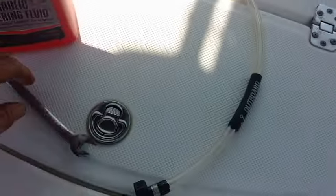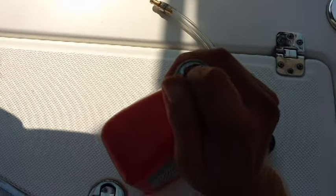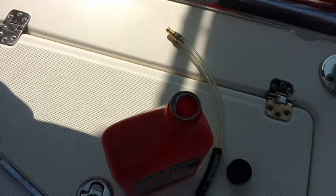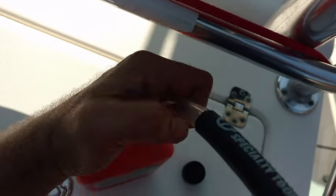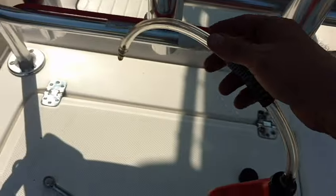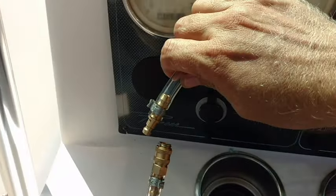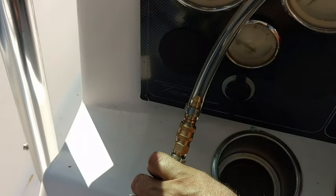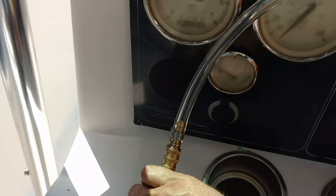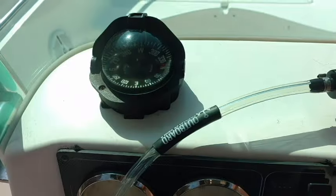Now up to the helm. Here we have our shiny fresh new bottle of incredibly pricey Sea Star fluid, which nobody wants to spill a lot of. It's probably a good demonstration of exactly how easy it is to use our system. Here we have our fill tube fitting and our helm fittings. Go ahead and connect up here, connect our fill tube. Now we've got the fill tube connected — make sure everything is nice and tight. Fill tube is connected up to the helm fittings.